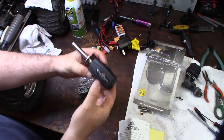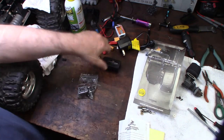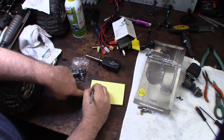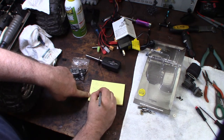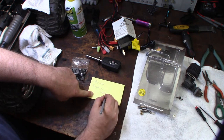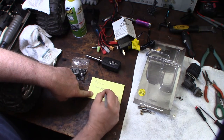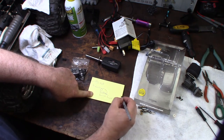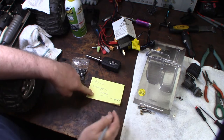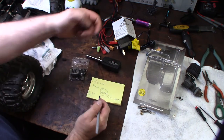That's why I'm thinking you can't front-charge it. There's actually a battery port in the back. Let me write down on paper how this thing actually operates. So here is the LiPo cell at 4.2 volts, which then hits a voltage regulator module — also known as a buck converter — and that steps it down to 1.2 volts. This is typically a PCB or integrated circuit, and it also works as a charging circuit, then steps the voltage down to the glow plug.